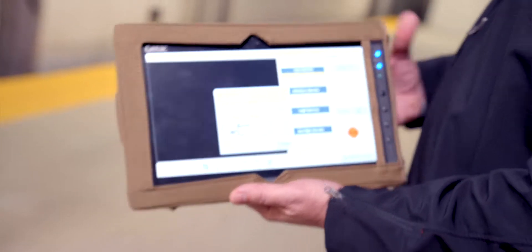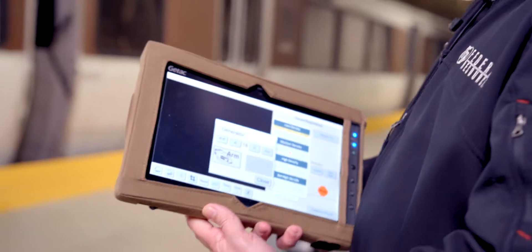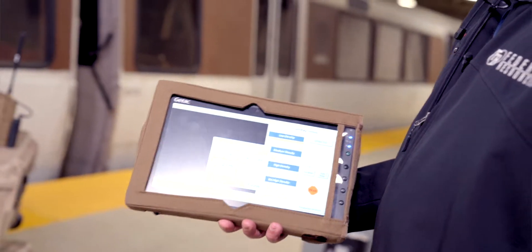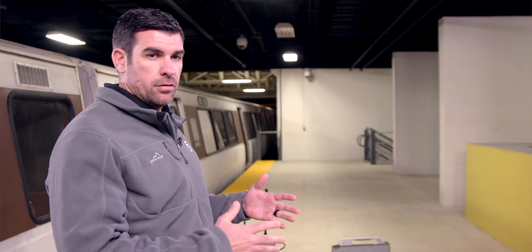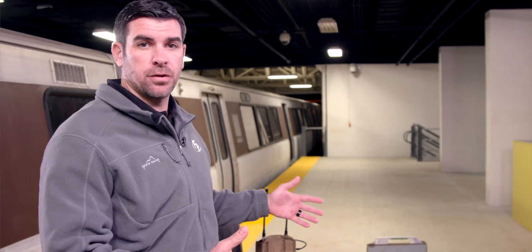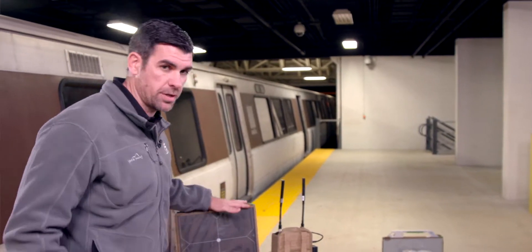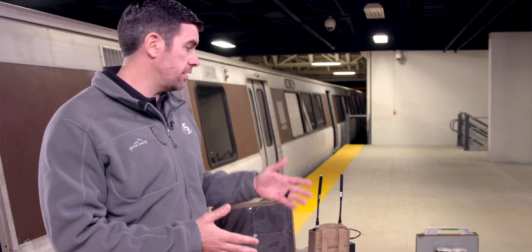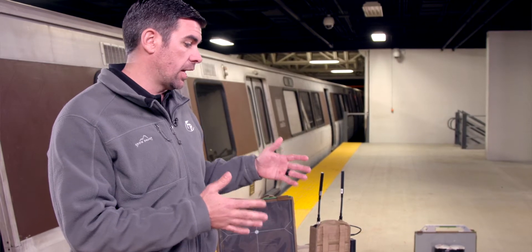From this distance, Dave, do you want to talk about the old standbys as far as pulse counts for film? So the old SOPs out there would be — some people say 4 foot, 40 pulses; some people say 6 foot, 60 pulses. With these digital read panels, I'm not going to say that goes out the window, but you don't need to stand by a strict SOP for that. These have the ability to capture a lot of imagery and a lot of energy from the generators.